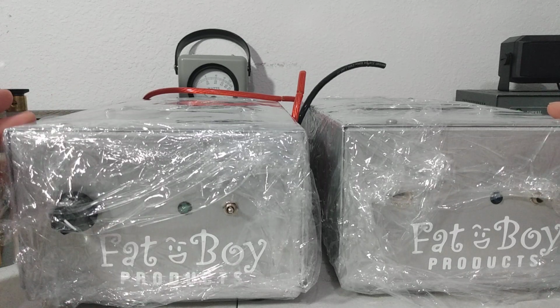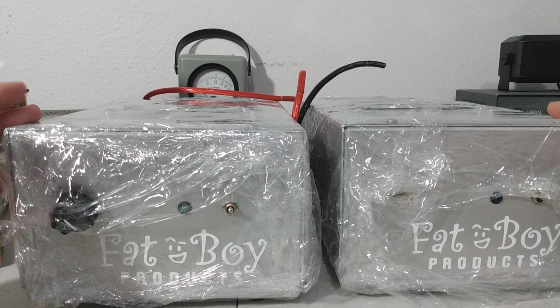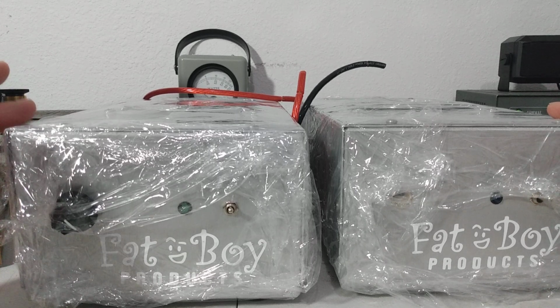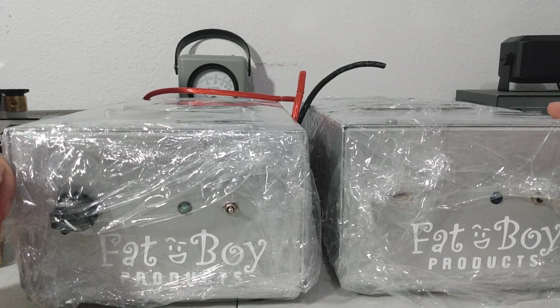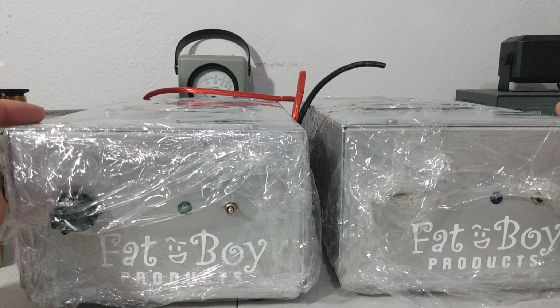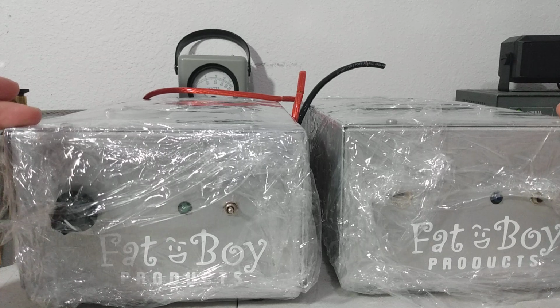Now on the low drive side, basically all the low drive amps are going to take the same, because most of them are going to have 2 transistors in the driver section. Most of them. Now there's people that make 4 driving 12s or stuff like that, but 90% of the amps that are designed this way, if they have a driver transistor built in, whether it's a 1 driving 4 or a 2 driving 4 or a 1 driving 2, they're going to be 35, 40 watt PEP max. Now, ones that have one driver transistor, like a one driving 4, they take a little bit less, or a one driving 2, they take a little bit less drive than a 2 driving 4, a 2 driving 8, something along those lines.